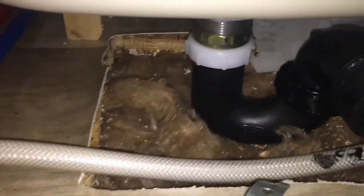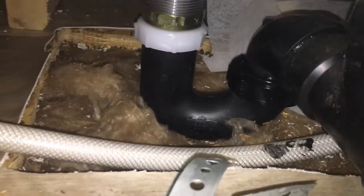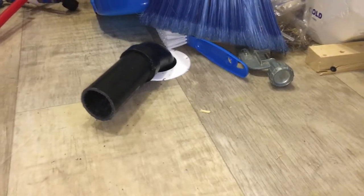The plan was to take the plumbing vent, which doesn't run outside. As you can see, there's already a hole here in the floor. The idea was to just drop the pipe straight down through the floor and then run it over and connect it to the gray water tank.